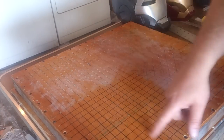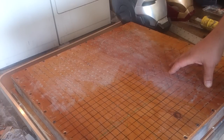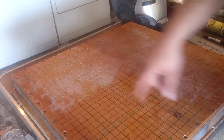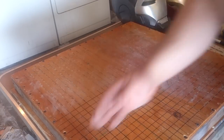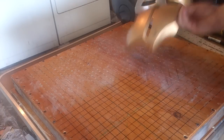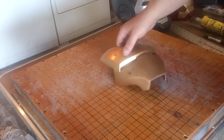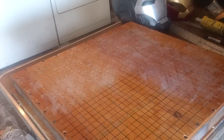As you can see, I've got the lines drawn in this. I've got holes drilled on this portion here and this portion here, and I'll be doing a time lapse for the rest. The way I've drilled these holes, I just lined them up and then did a grid and started drilling them. What this table allows me to do is quickly prototype sculpted parts — let's say I want to do a face plate, put it right in the center and vacuform it. Basically it would give me a form of this face plate, which would be a vacuform buck.